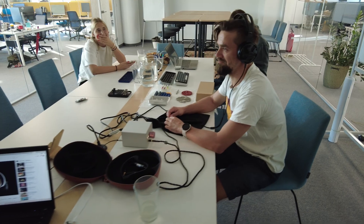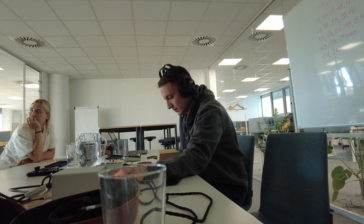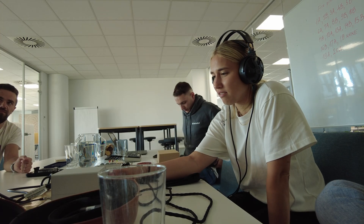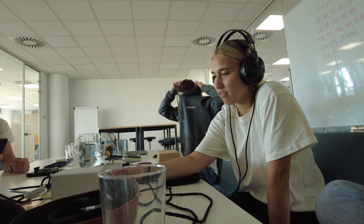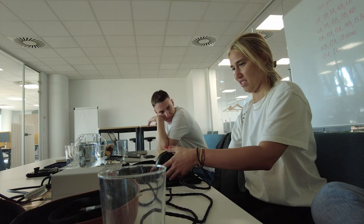Several people have tried out this amplifier and were really pleased with the results. I was personally quite skeptical at first, thinking my hearing wasn't as good as when I was a kid and I probably wouldn't notice major differences. However, I was quite surprised — the sheer power this amplifier can deliver really does make a difference on high-impedance headphones. I do plan on making a full dedicated video on the hardware design, as I'm still making changes to the power supply. Early tests such as a Bode plot for the gain show it's very flat after 25 Hz, and the same goes for group delay — very consistent after roughly 25 Hz.